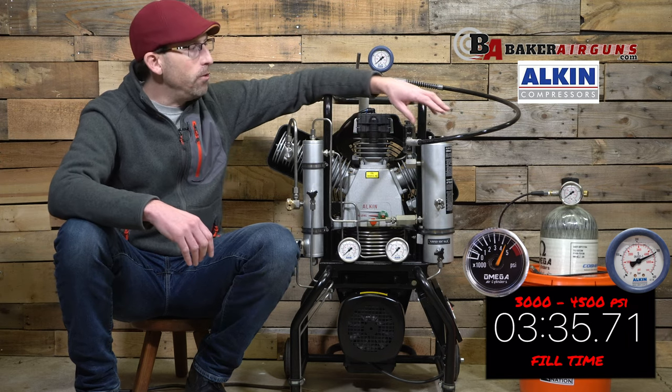You might be saying to yourself, that's an expensive endeavor — and it is. But keep in mind, what does 1,000 hours of use look like for the typical air gunner? If it takes 15 minutes to refill your tank, that's about 4,000 fills before you hit 1,000 hours. Are you saving money? Most places charge about $7 to top off a tank, and $7 times 4,000 fills equals about $28,000 — wait, that's $28,000 in shop fills. So yes, a compressor of this size, although expensive, can really save you money in the long haul.